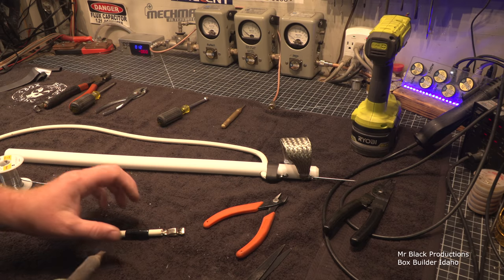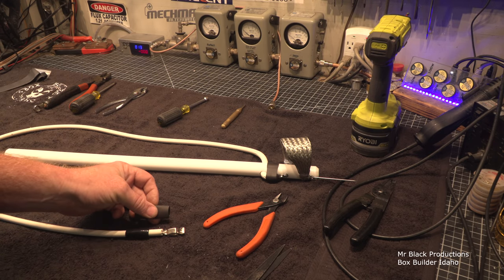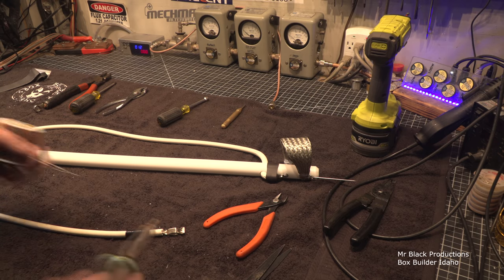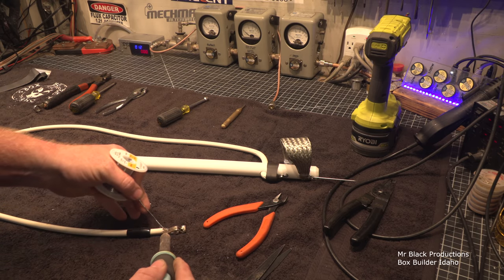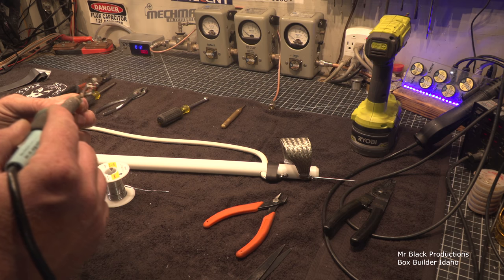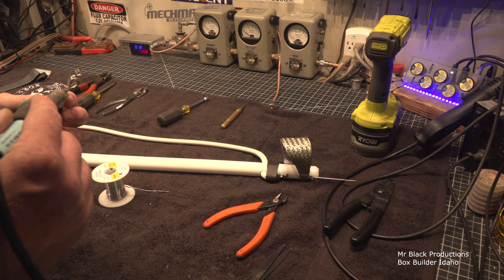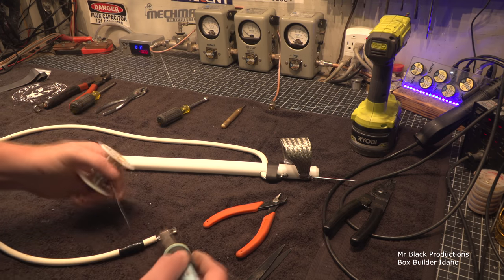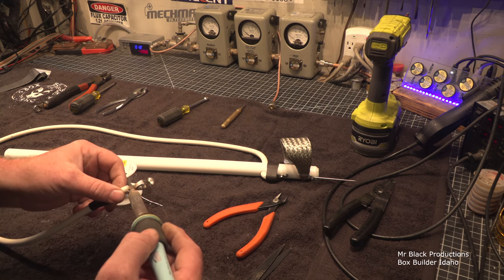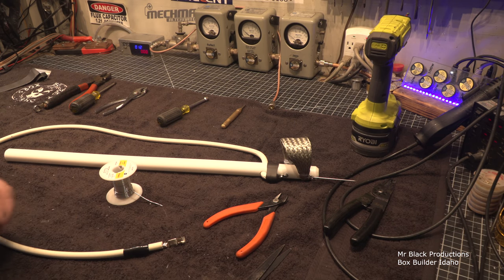we're going to solder this, and then we are going to sneak some more marine grade heat shrink underneath this clip end, and then we'll be done. So, let's pretend like we know what we're doing with the solder. There it goes. Is that a little bit more? We can make sure we get the wire nice and stiff all the way up inside the jacket so it'll break in a place that we cannot easily find. Nope, there we go, we got a good joint.